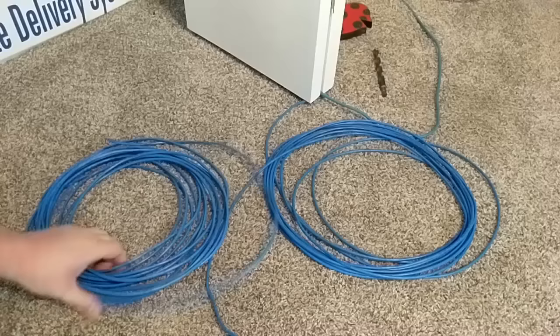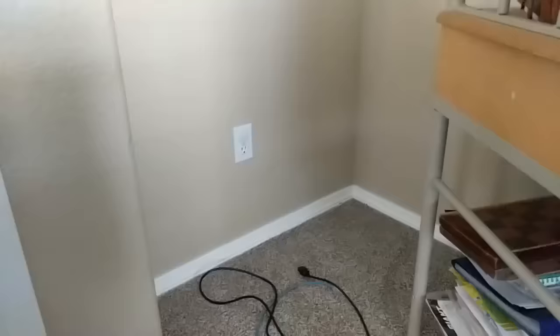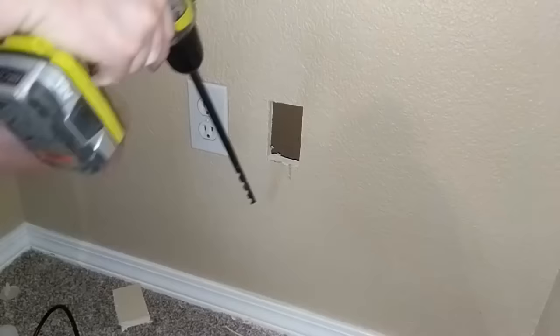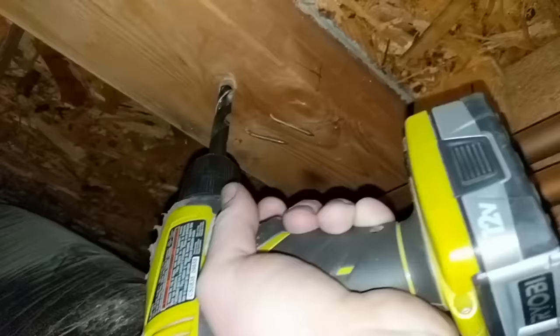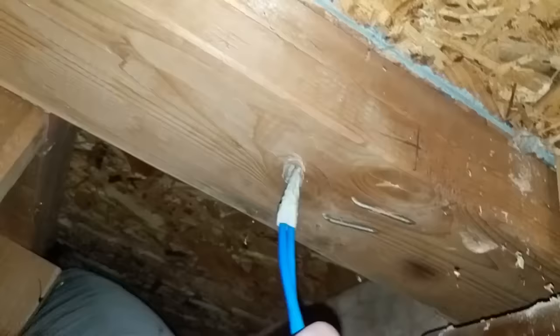Once the hole is cut, we can move on. Since I'm running two cables, I find the ends of the bare cable, stagger them, and tape them together — this makes fishing them around the walls easier. Get a mental picture of where you need to drill so you can find it when you go into the crawl space. If your hole is low enough or your drill bit is long enough, you can drill right down from the hole, or drill a tiny hole in the drywall to do the same and patch it later. Make sure you know what is below so you don't drill through another wire or pipe. In my case, I went into the crawl space to drill up. I found where I needed to drill — here is the power cord going up into the same cavity — then I drilled up into the wall cavity. Make sure you know where you're drilling so you don't go through something you don't want to, or through your floor.